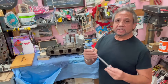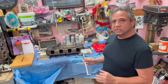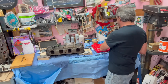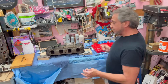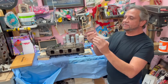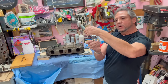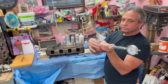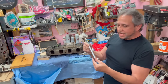With any measuring instrument you want to be careful — don't be dropping it or doing anything stupid. The bore is 4.015, and this anvil is four inches, so that's not going to work since the bore is bigger than that. I'm going to add a 20-thousandths shim to it. I like to keep everything in the case when I'm done so I don't lose things, especially the small pieces. You slide the shim on the anvil, put the collar on, and screw it down — simple as pie. That little tip sticking out is what makes the gauge work back and forth. Now it's set up for 4.020.